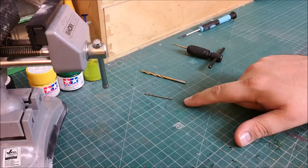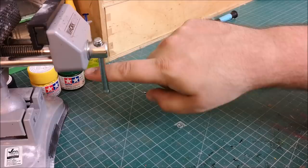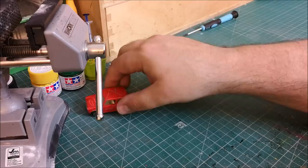So we start by removing the rivet, drill down the centre of the post, remove the flange and tap the hole — not forgetting my very handy vise.